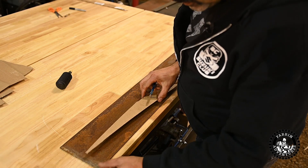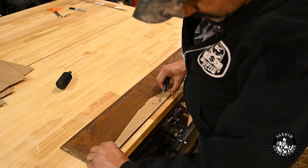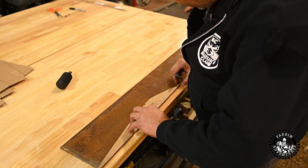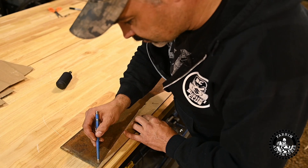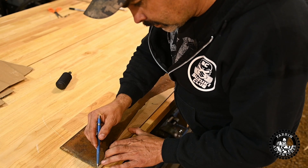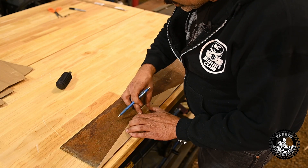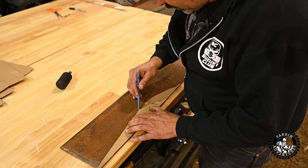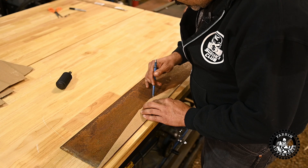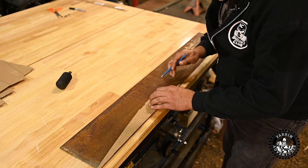The vertical webbing of this truss is just going to be made from eighth-inch plain old mild steel. We're going to trace it out, cut her out with the plasma cutter, and see how she fits up. Then the top piece that goes on top will be a little heavier - it'll be 3/16" plate - and I think that should make a sufficiently strong truss.